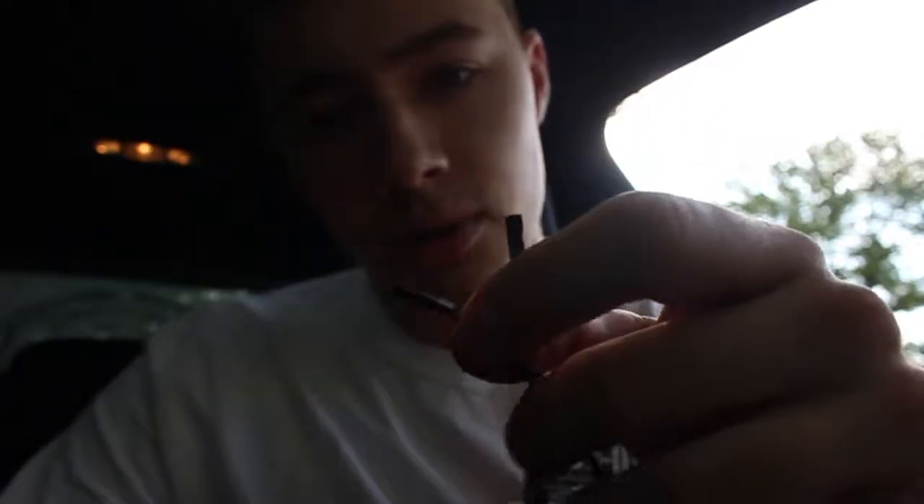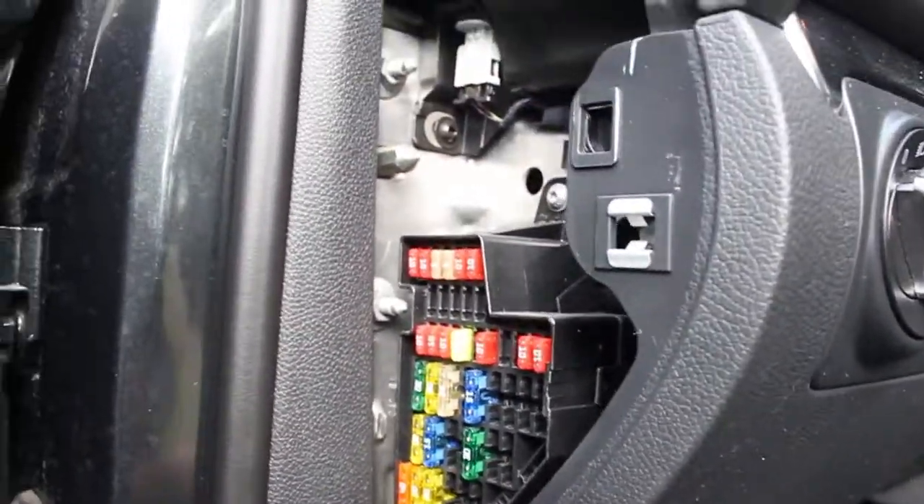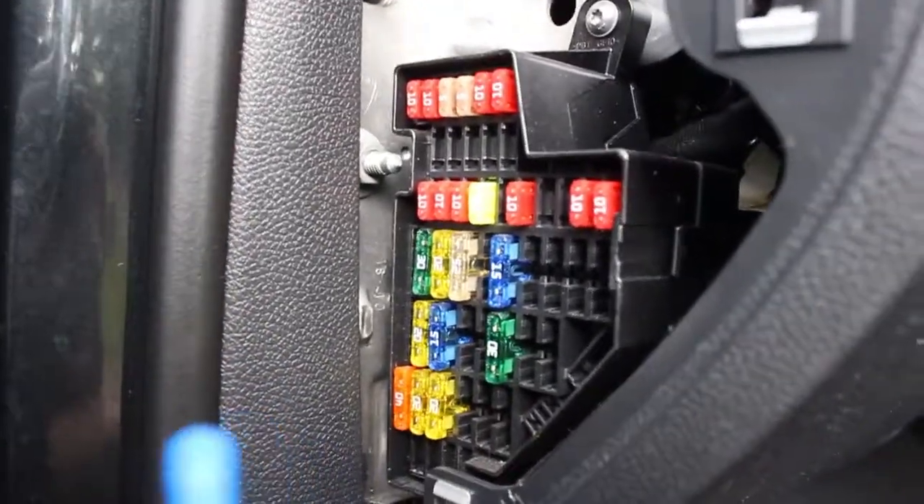This plugs into the Arduino and reads data straight from it. To power the LEDs I bought, I need at least five volts with 2.1 amps. In order to get power from your car — instead of running straight from the battery, which can be dangerous and not very clean — you want to tap into the fuse box. The amperage I need isn't going to be a problem because the fuses are 20, 30, and 10 amps each.